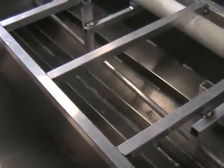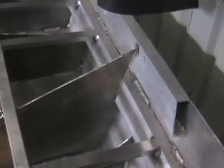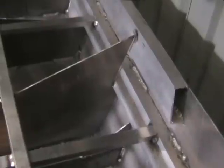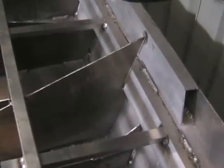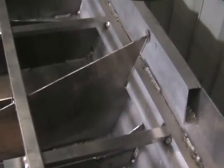Also, there is a 100mm stringer right up the keel that gives the keel the strength, even though it's a solid keel anyway. And then that has a massive bracket that runs all the way up to the back of the transom, right up underneath the motor. There's no flex at all in the transom once the motor's on. It's capable of taking a 200 plus motor.